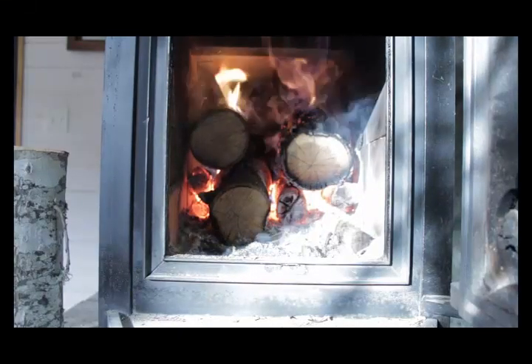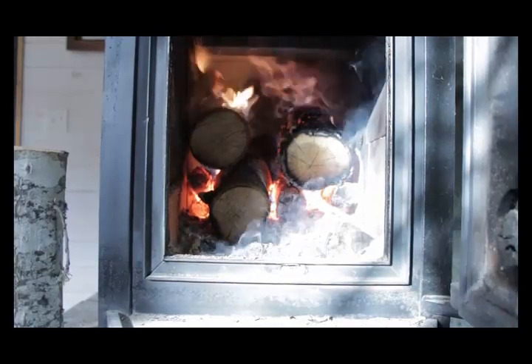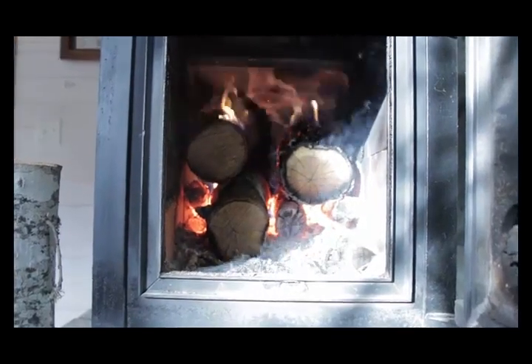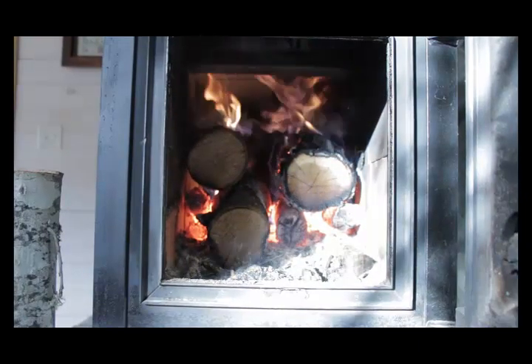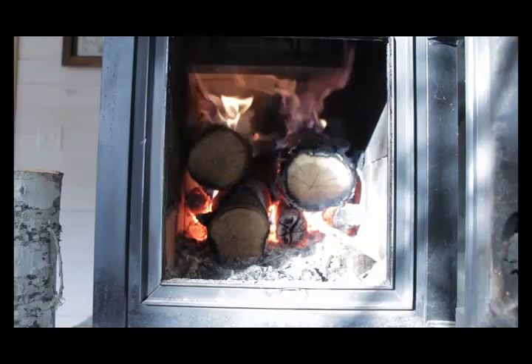From here we back off and look inside the firebox with it stacked full of wood. It's important to push the wood to the back — that way the flames heat the air coming up the pipe to superheat it, so where it comes out of the bar on the top it will inject that air and make the fire boil like this.